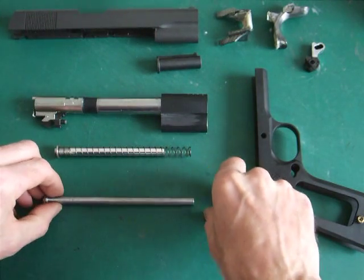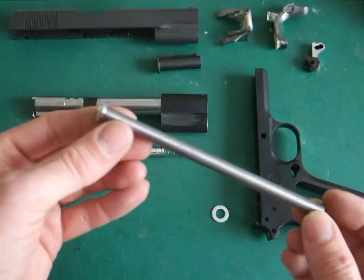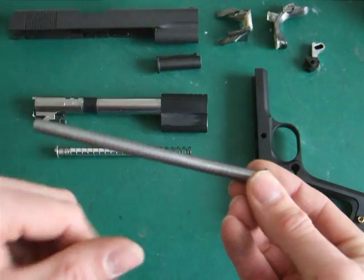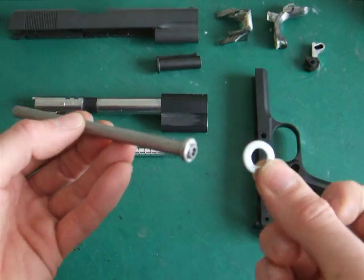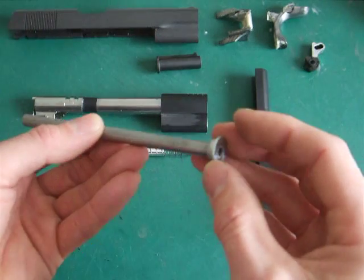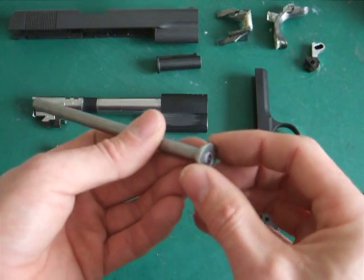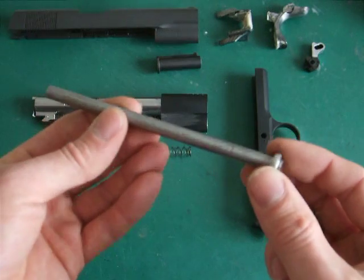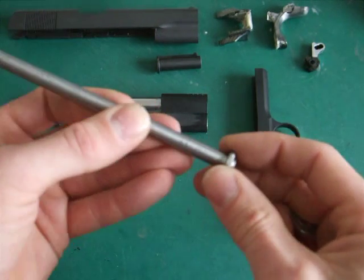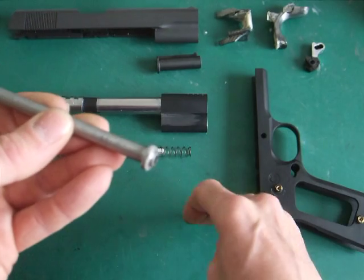Along with the guide rods — I made up, or had a friend make up, some guide rods cut from steel rod. What he does is take a washer of the same or pretty much the same diameter as the rod, slots it on the end, and it's bronzed onto the end of the guide rod. Then a small drill hole is put in and a pin is put through to help with structure so it stays on — so even if the bronzing gives way, the pin won't.